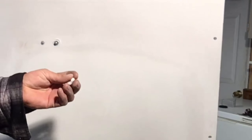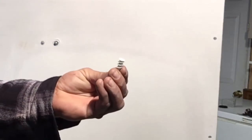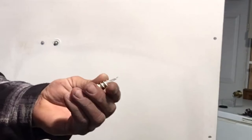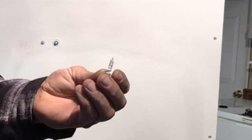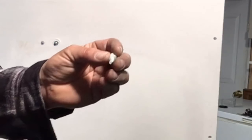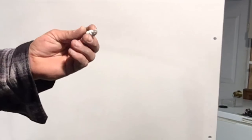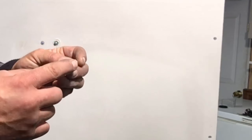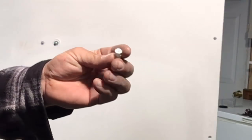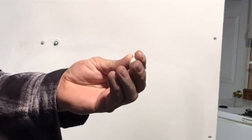Now I have a plastic easy screw — they call them easy anchors. These are plastic and also self-drilling. However, on half-inch drywall you'll be able to self-drill these in. If you're in an area where you've taped, these may not work because the heat seems to dull the tip. And in five-eighths drywall, you'll definitely melt the tip and it won't drill in by itself. I like to drill a little pilot hole with these.